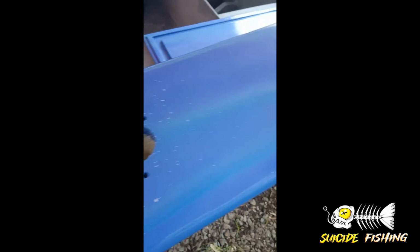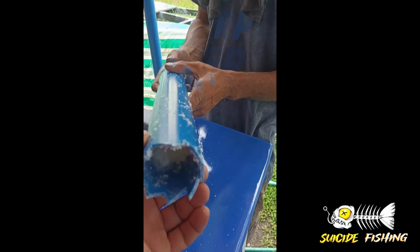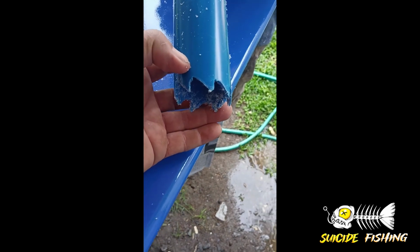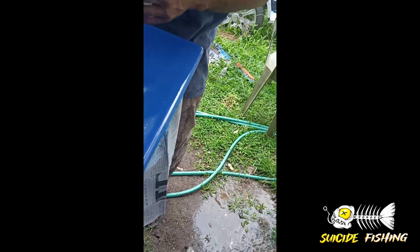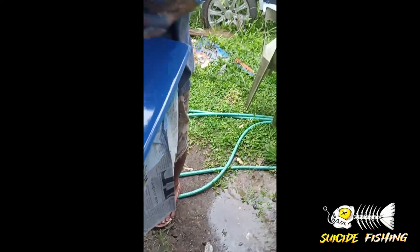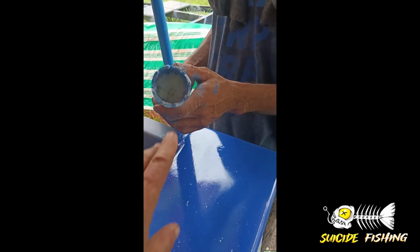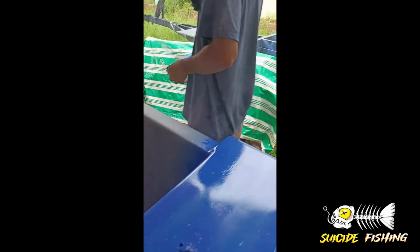And the easiest way that we came up with, let's see that. So is a piece of PVC pipe that matches the diameter of the fishing rod holder. Took a grinder with a cutting wheel and we made teeth on there. And what you saw Dennis doing earlier is you stick it in there and twist. And as he twists, it goes in there deeper. And when he pulls it out, the foam is stuck in there, and all we do is push it out. And then we've got our hole in the expanding foam, okay?